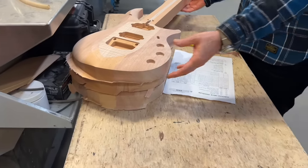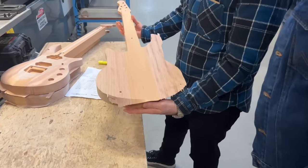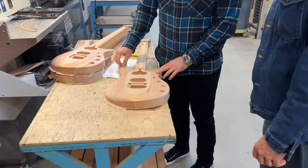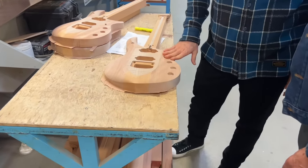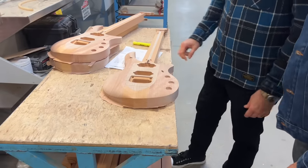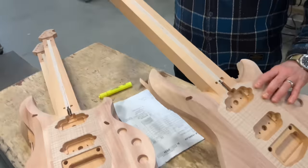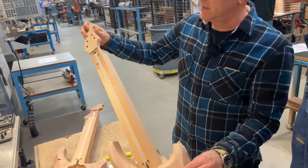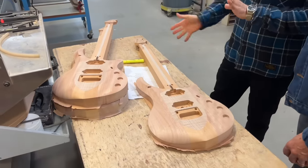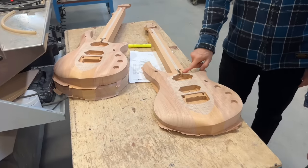This one here uses a lot of different pieces of wood. Starting with the back, you've got some mahogany going through there. We have basswood or alder wings depending upon the model — it could also be black limba — and we've got some flame maple shielding. The headstock is attached with the scarf joint. This one just hasn't been sanded yet, but you can see that. It'll be placed on there and shaped, and then we'll put the ebony fretboard on it later. We're using a single-action truss rod on these.